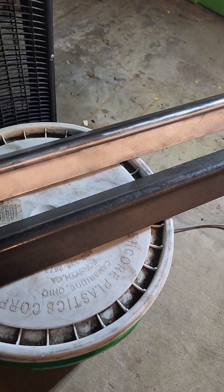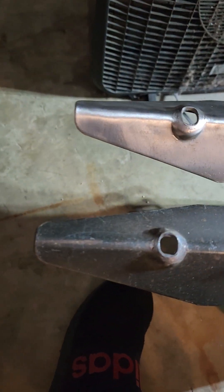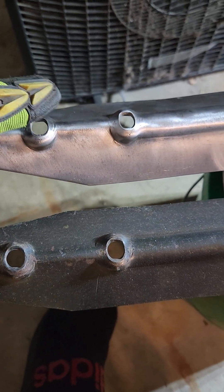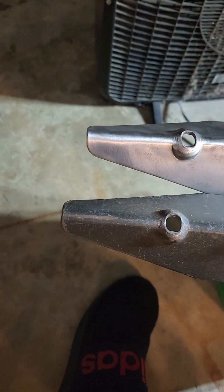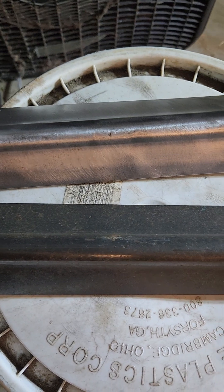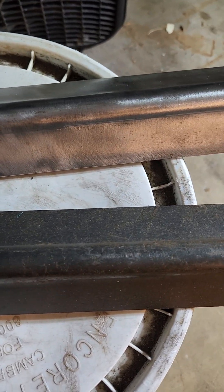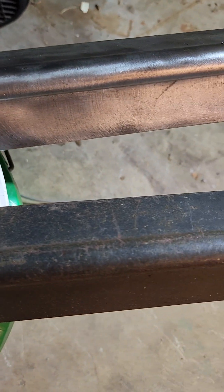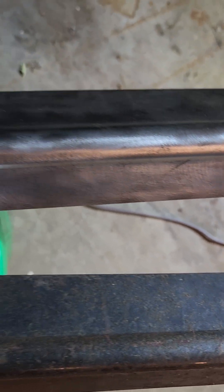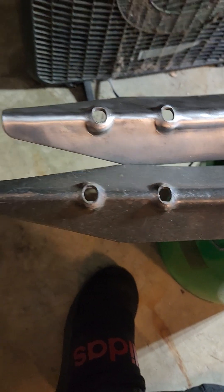Just to give you a comparison again, after we got this one completed — from what we had to start working with, to where we're at and going with them. This really gives you a look at kind of what I'm going for anyway, to get these things ready to paint. I want all this little pitting that I can get out, every little bit of rust knocked off. Going ahead and knocking all that old paint off, come back and completely reprime them and paint them as well.